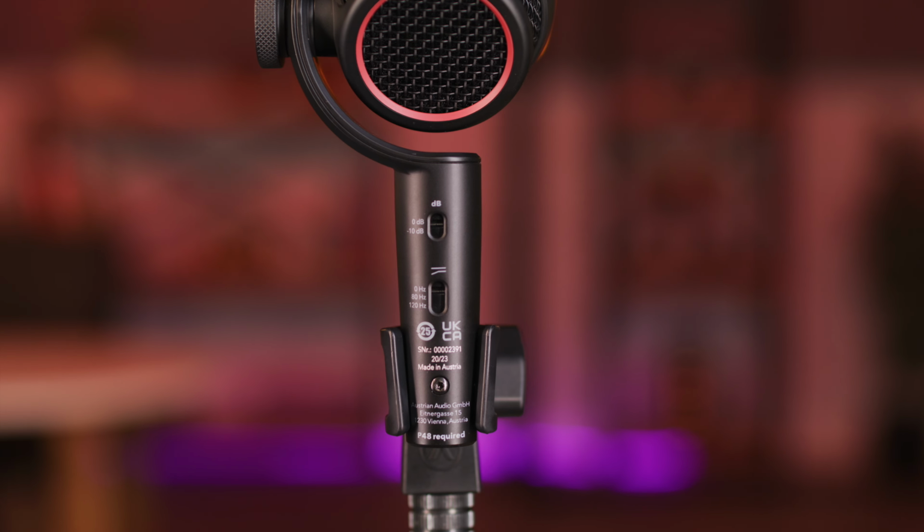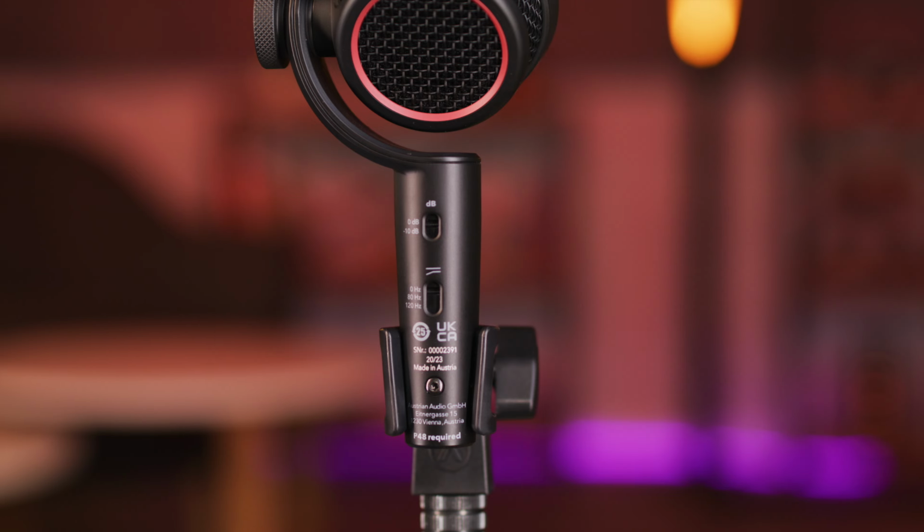Now, when I read on the OD5, P48 required. And I was like, why does a dynamic mic need phantom power? And I called them and said, hey, Bernd, I need phantom power. And he said, well, it's an active dynamic mic. What? Huh? So it means, yes, it creates the current like a dynamic mic does. It has all the traits of a dynamic mic.